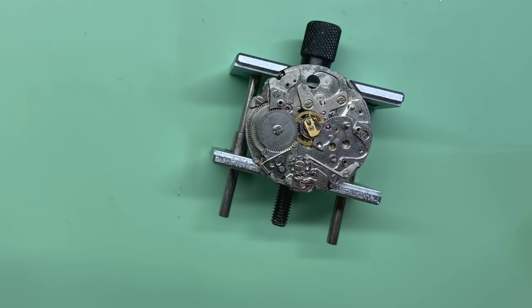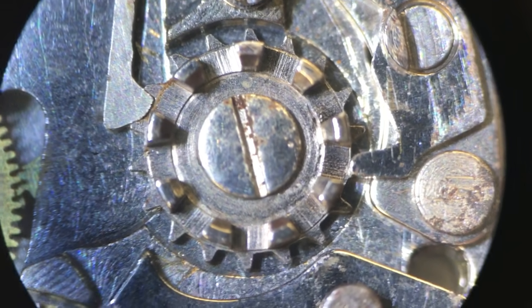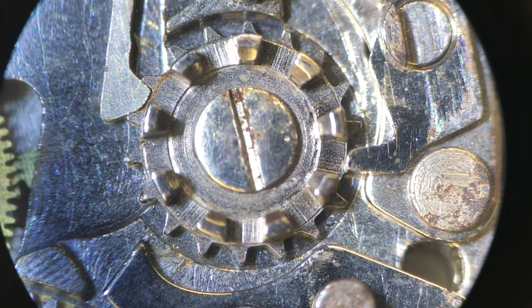It tries to tell you that really you're sort of oiling every single face, so I'm guessing you oil one or two here and there, and as the column wheel rotates, it sort of finds its way around. So I'm going to just try and have a little bit of a go with that, and hopefully it comes out all right. Okay, so now you're looking at the column wheel, and if you look in the service manual, it basically tells us to oil the teeth here.